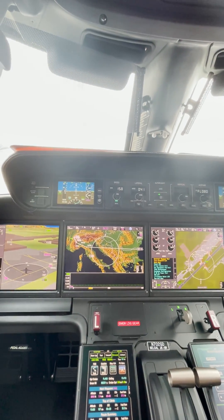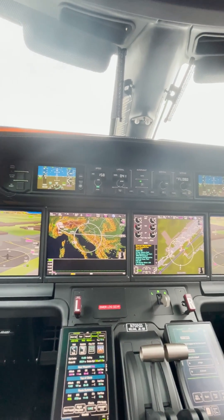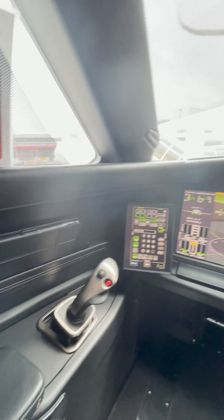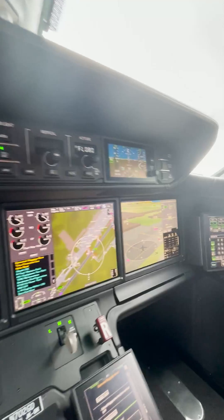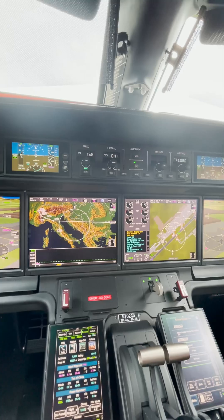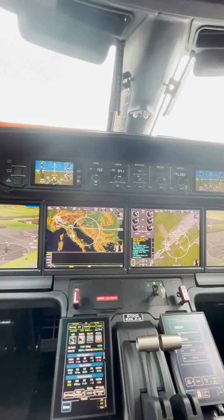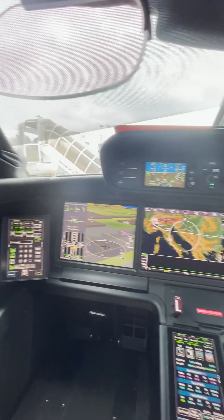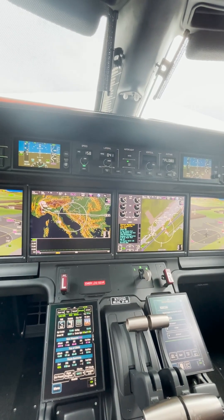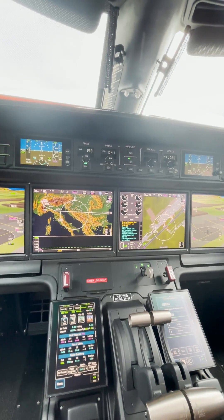There are three unique things in this airplane that together create what the Symmetry Flight Deck is. The first is the active control side stick — you can see that it's moving, and I'm moving it on this side at the same time it's moving on the other side. The active part of that process is what makes it so unique. It's not a passive side stick like in some other airplanes; this allows us to get feedback from the other pilot so both of us know what we're flying. It also allows the airplane to talk to you — if you're out of trim, fast, or slow, all of that feedback comes back through this stick.